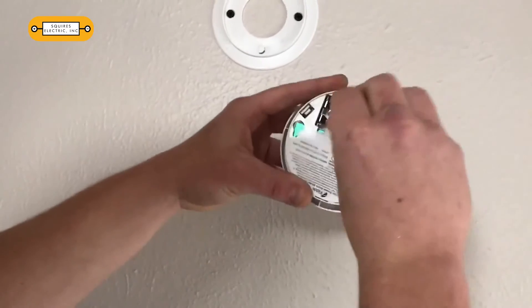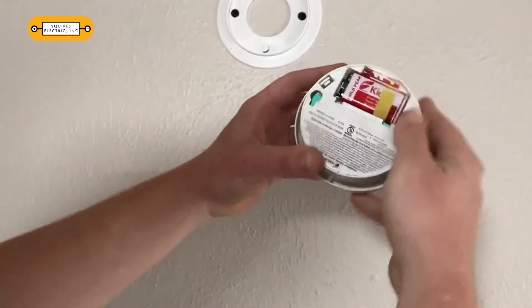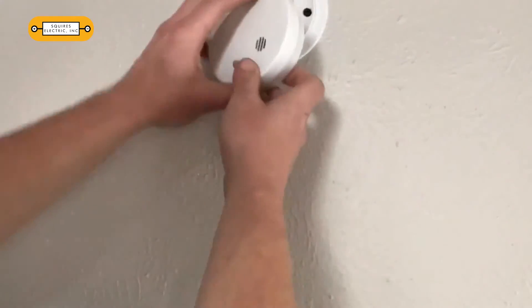Check your smoke alarms. Install fresh batteries — we recommend lithium ion — and write the replacement date inside the cover. A light dusting or vacuum can ensure proper function. Side note: hard-wired smoke detectors throughout the property should be the same make and model for the best function.